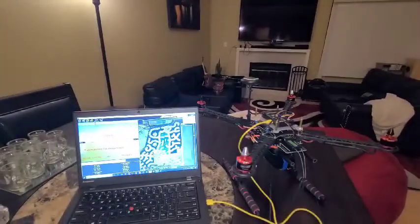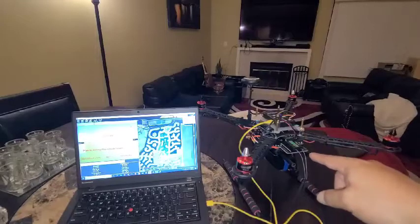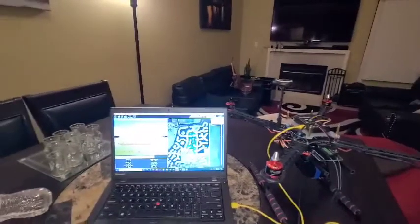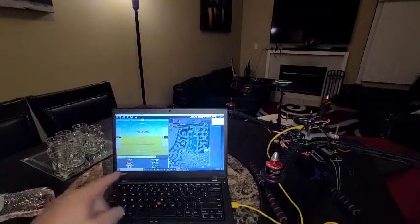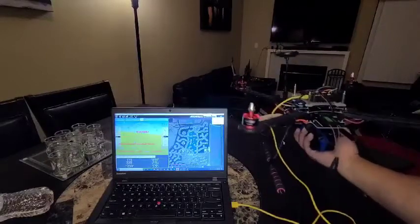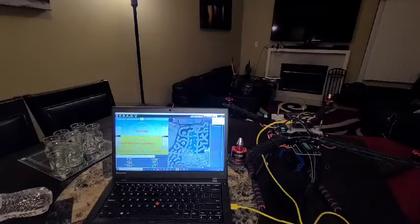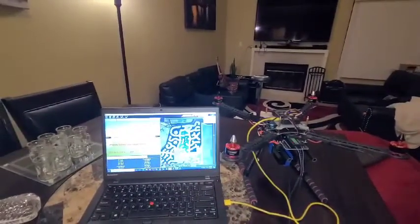So, I had to do a bunch of accelerometer and magnetometer tests on these things and calibration. So, if you watch over here, you'll see this little horizon window move when I move this. So the accelerometer and everything is all tweaked, and as soon as we get the radio telemetry, we'll totally be untethered. So that's good there.